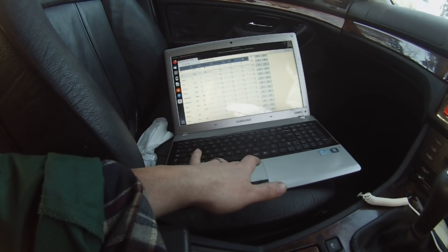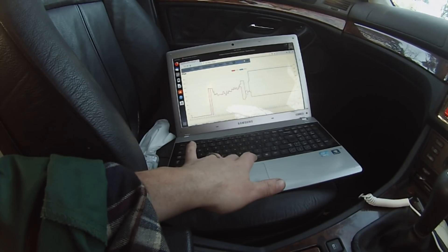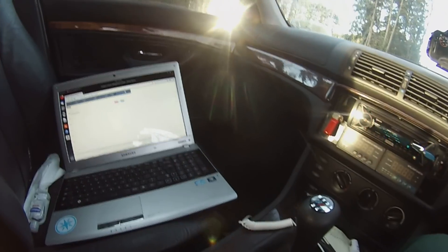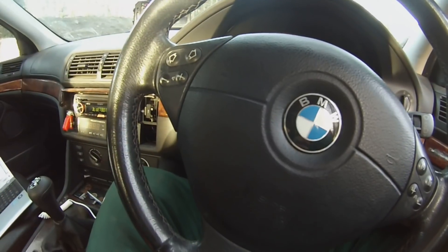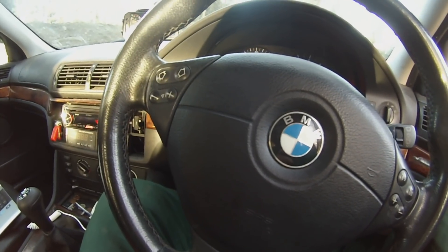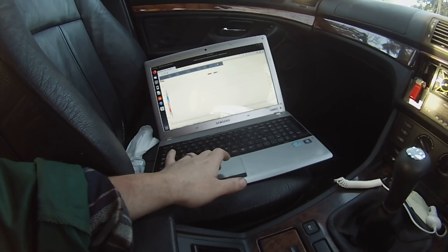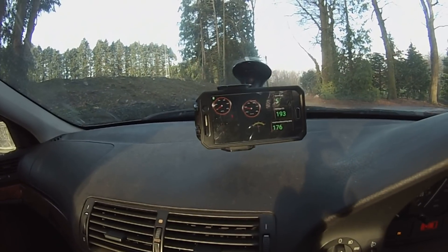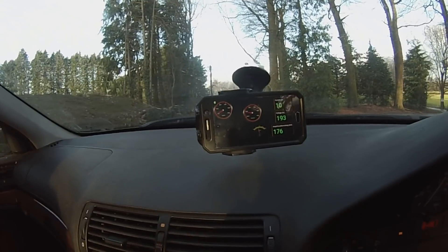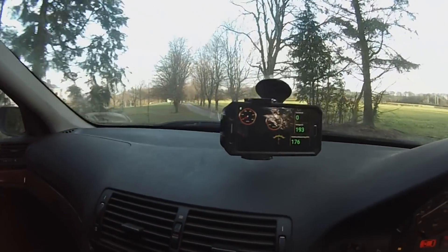The other strange thing is that the motor seems to not be sure which way it wants to turn, which is weird. Let's just do a plot of current. I'm going to have to restart — one thing I don't like about the BMWs is you can't turn the key to start after you've already turned it, so I just do a quick flick. There we go, we're on now. So I should be able to just restart that plot — yeah, there it goes. Let's select second gear; we're on a little bit of a downhill here. I'm going to show you guys battery current — I'm actually pulling away pretty well here, but we're going down a hill, so I go on a bit of throttle and get to about 30 amps.